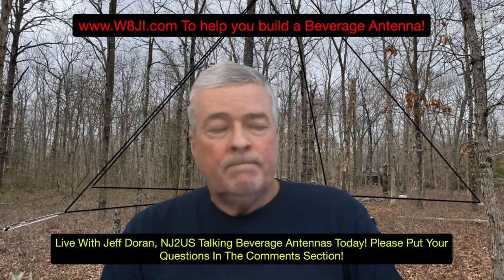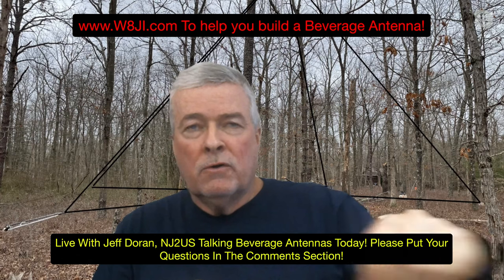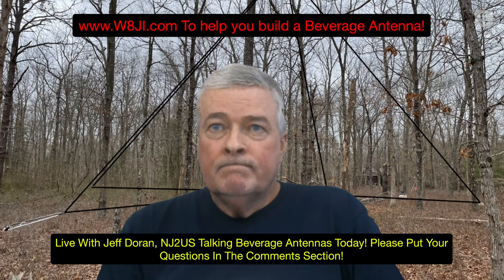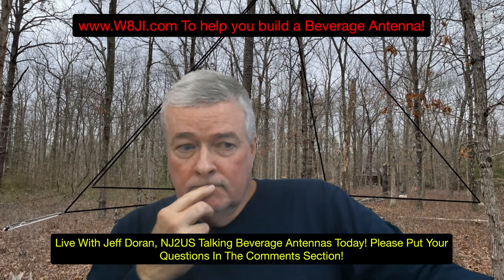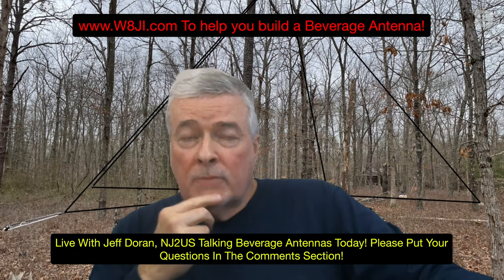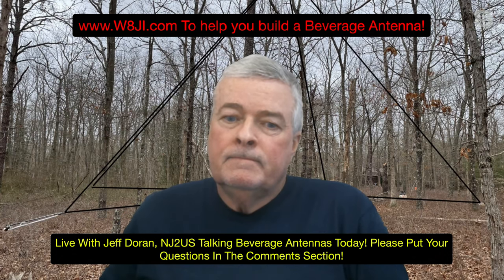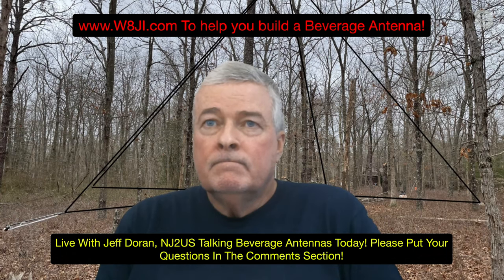A 600-foot beverage gives you a lower noise floor, but you'll still lower your noise floor at 200 feet, or even 75 feet — lower than a receive antenna at 50 feet because it's near the ground, and that's where the signals go. This is a totally different concept for hams to understand. You can't work unless you can hear — that's the big difference. This is not just for hams; if you like to DX the AM dial or you're a shortwave listener, this is an amazing antenna. You'll hear stations you could never hear before because the noise was covering them, and QSB fade will be reduced too.